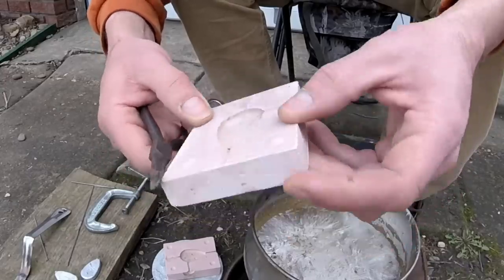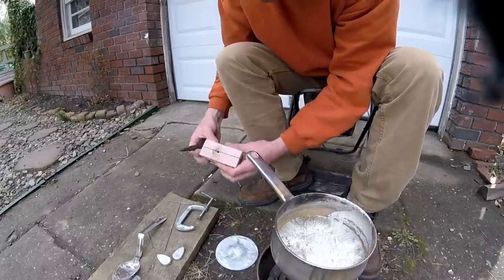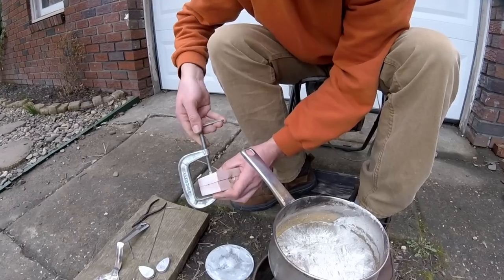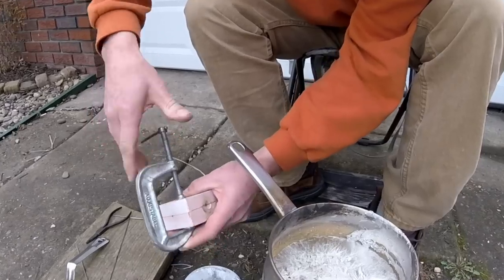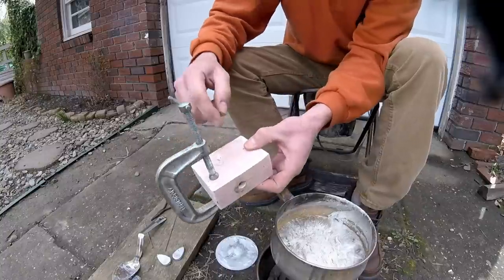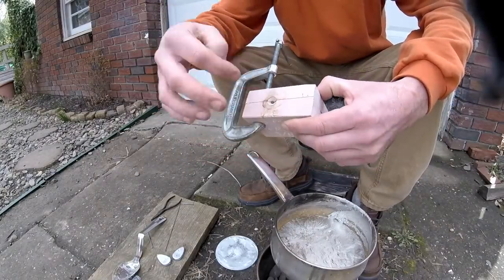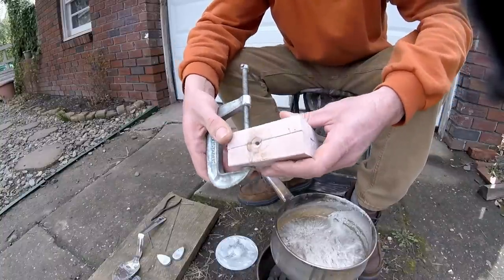A little bit more hardener, and that looks a lot better. Like I said, this is a learning experience. Plus, I think I need to grab another C clamp, because this stuff gets kind of hot having the lead in it. So clamp it on either side, like there and there, instead of in the center where the void is that we're pouring. When you clamp it in the center, once it gets hot, it flares the edges. This edge will go up this way, this edge will go up that way, on both sides. I don't know, that's just what I think is logical.